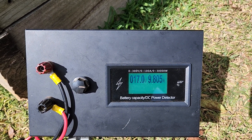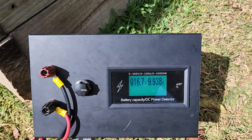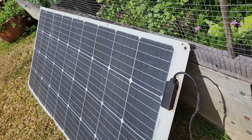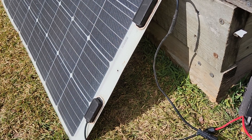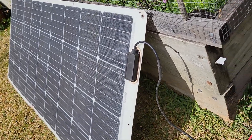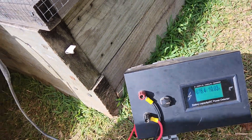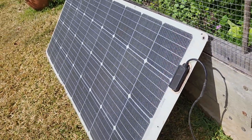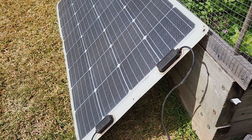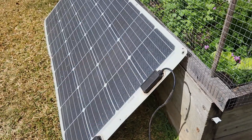As you can see, it's got adequate power to drive an MPPT controller at around the 10-amp mark. The Sun is in the northern part of the sky for us at the moment so it's not optimum. I'm sure the two panels when I first put them on gave me around 25 amps. These panels are supposed to have SunPower cells in them, which are pretty good and perform very well. They're lightweight — weighing three kilograms — so very light. Do not ever put these directly on the roof though, because they get very hot on the back. I'd recommend spacing them on 12-millimetre (half-inch) square aluminium rails — three of them: one down the middle and one on each side.